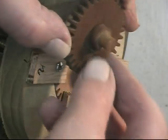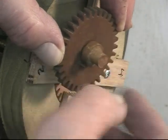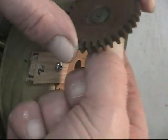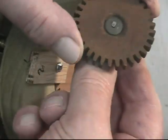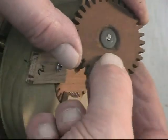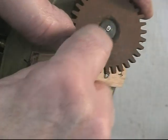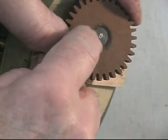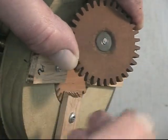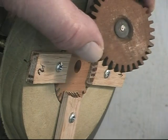The original gear has a hub that rotates. So I'm going to make about a 4/1000th clearance between the hole and the diameter of this little shaft. Also, it's held in with a washer and some kind of a nail. And it's countersunk, as you see it. Someone did it with a hand chisel. I'm going to cut it with a cutting tool. Use this same faceplate to do that operation.